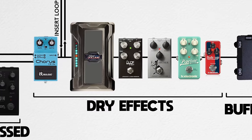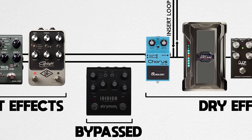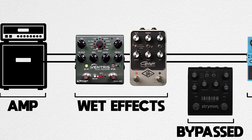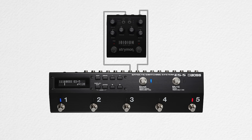If you did want to use your amp-less rig through a regular guitar amp on occasion, most amp-less systems allow you to bypass them, so your pedal board just becomes a standard serialized pedal board. In Mitch's case it would go from the chorus in stereo, then to the Starlight, then to the Ventress, cutting the Iridium out. Some don't have true bypass; you can put those into a true bypass looper or a loop on a switcher to completely hard bypass it when running into a normal amplifier.